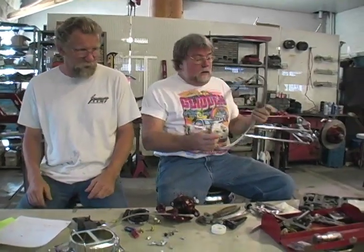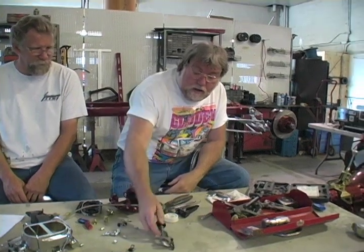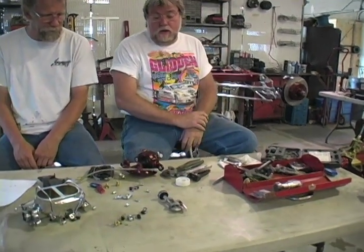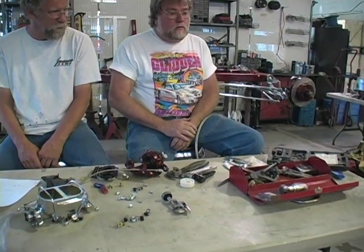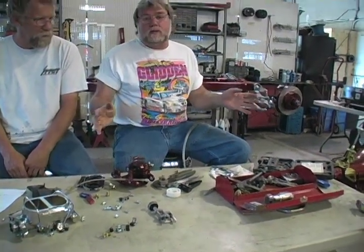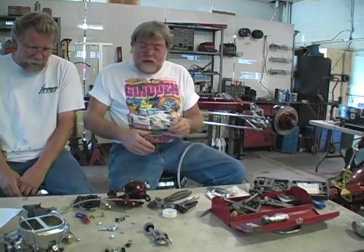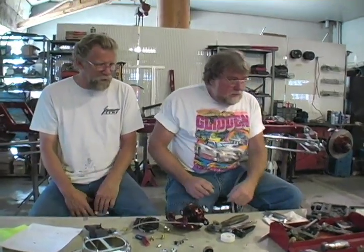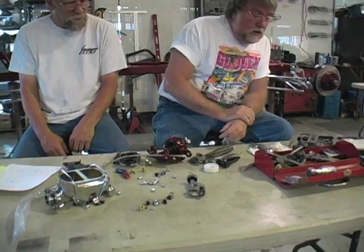Show us some of those tools. Let's set this aside. First off, you need a cutter. In order to cut your lengths, the best thing to do is measure out about what you're going to use. Cut a little bit extra because you can always cut back, but you can't add on. You start on one end, and when you get there with all your bends, you cut the other end again.